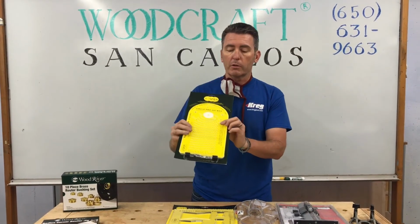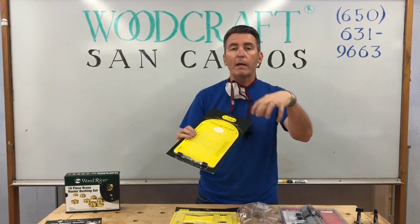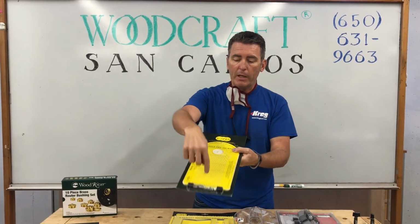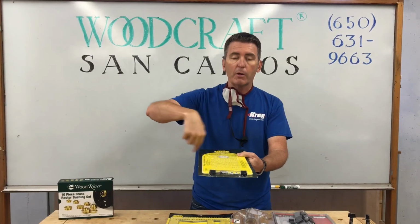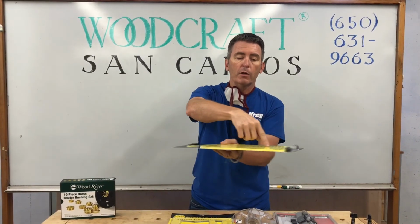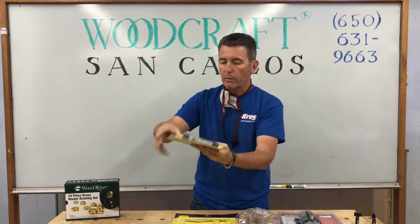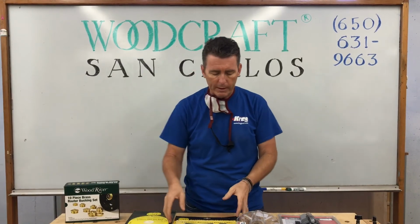This is also a circle cutter. You would take your router and replace this base with the base that's on the fixed base that you've got, and then this guy has a pin. There's umpteen jillion holes. You put the pin in here to find the diameter of the hole that you want, and then off you go and you make your circle around. That's a great one. And they make these huge. You can make giant circles because this comes in much bigger than that.